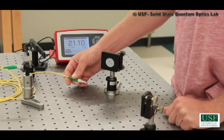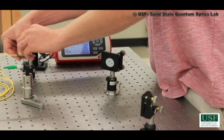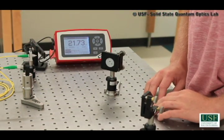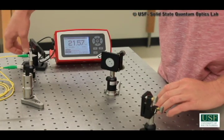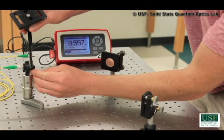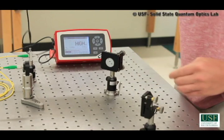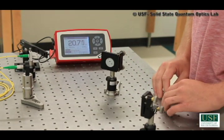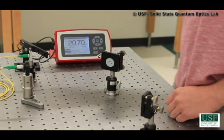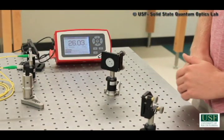Now that we've just coupled into the fiber, I can take the back end of the fiber and place it on the holder. The first thing we need to do is figure out how much we can couple into this fiber, and to do that we need to measure the power that's going into the lens. It looks like we're about 8.8 milliwatts. A good rule of thumb is a minimum of 50% coupling, so that means we need to couple in at least 4.4 milliwatts. I place the head of the power meter at the end of the fiber to measure how much is actually being coupled in.